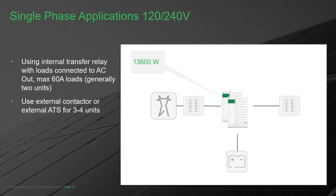With the overload capability of 17k for 30 minutes — what if this customer needs more power? We can do three: one master, two slaves. For 120/240 this is a 20.4k system with a 25.5k overload for 20 minutes. Now I'm also showing you a transfer switch here. You may or may not need this transfer switch with three units — I'll give you the guidelines on exactly when to make that decision, and it's basically related to the 60-amp relay, which I'll show in a couple of slides.